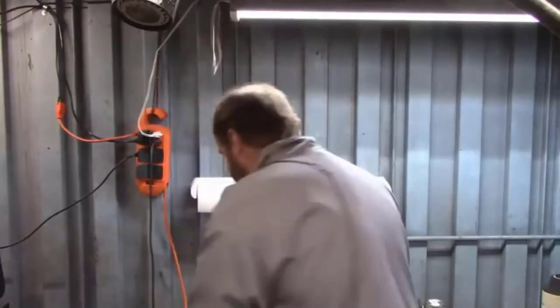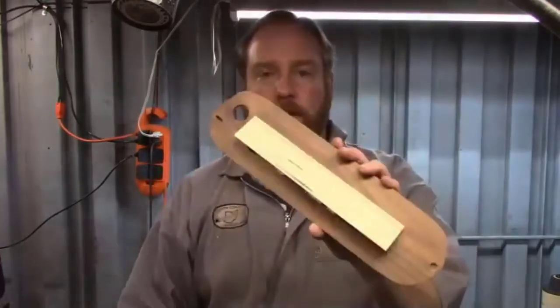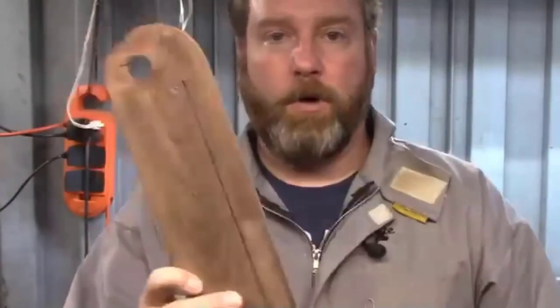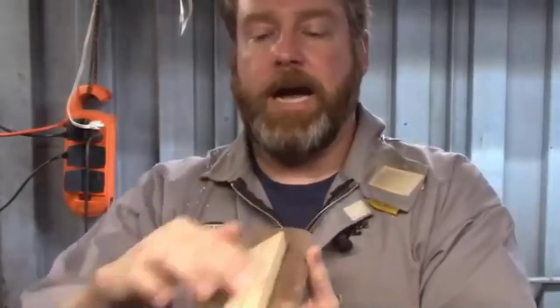Getting back to the table saw, the extra piece on the other side of the blade, how is that held on? Oh, okay. That's a good question. See, all these things I forgot to talk about. So in the video where you create your wedgie sled, they describe how to create this, which is this little ramp you're asking about, and a sacrificial throat plate. So this is a zero clearance throat plate that you make up to fit your table saw. And then you're just going to attach on this with just two screws. No big deal.